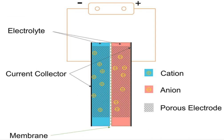The capacitance value of a supercapacitor depends strongly on the measurement frequency, which is related to the porous electrode structure and the limited electrolyte's ion mobility. Even at a low frequency of 10 Hz, the measured capacitance value drops from 100 to 20% of the DC capacitance value. This extraordinary strong frequency dependence can be explained by the different distances the ions have to move in the electrode's pores. The area at the beginning of the pores can easily be accessed by the ions.